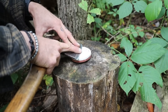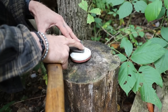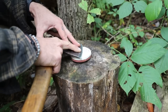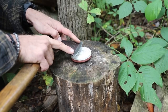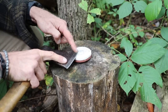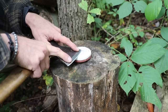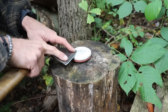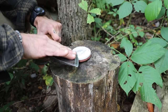At that point we need to keep that angle in place and we can either push along the stone or drag away from the stone. I have not seen any difference in trying both techniques in order to sharpen our tools. We want to make sure we're keeping consistent pressure wherever we are actually cutting — we're cutting metal away from this with our stone. I like to keep my fingers along this edge here. Find that correct bevel, then slide it forward keeping constant, consistent pressure along there. Then we would flip and go the other way.